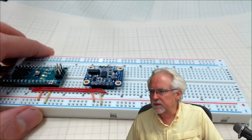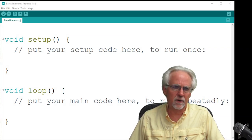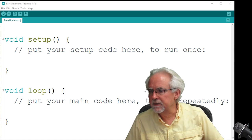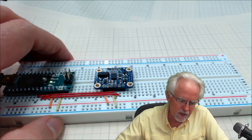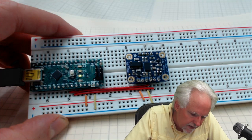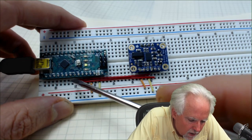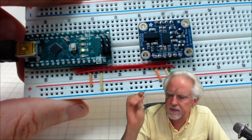In order to do that, we'll come up to the code view and open your Arduino IDE. The first thing we should do is how to hook the sensor up. It is relatively simple — it is an I2C sensor. On the Arduino Nano, the I2C buses are pins A4 and A5.